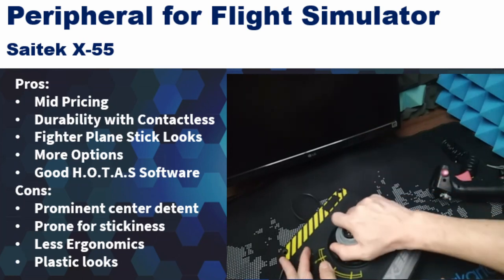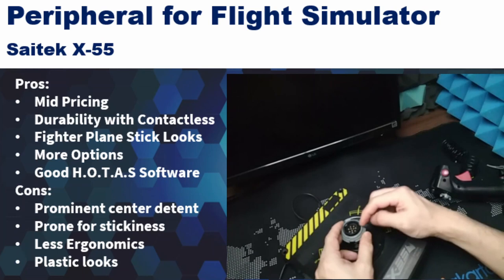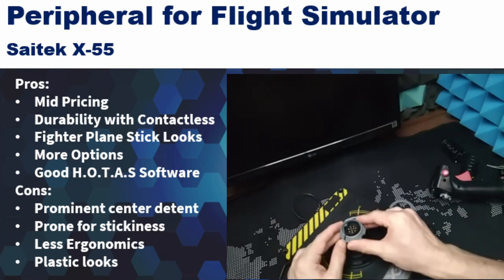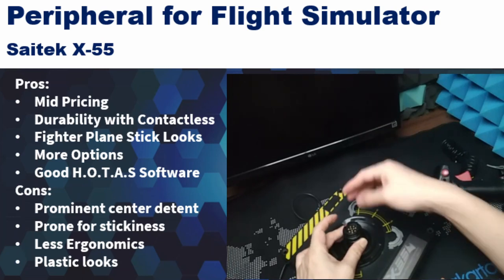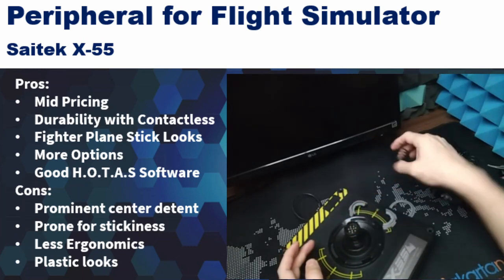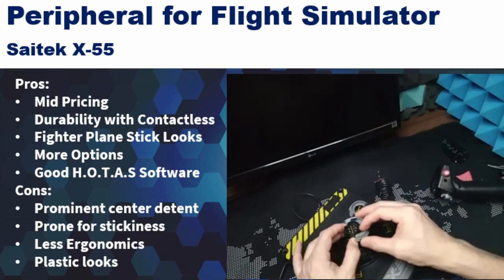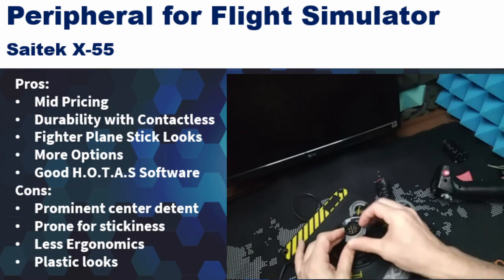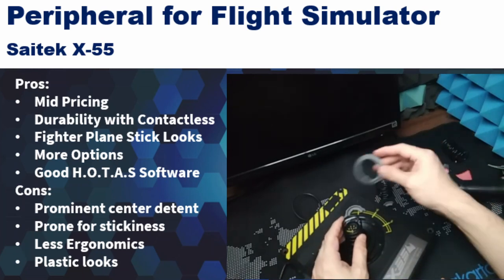So if you want to access the spring, I think you have to just unclip this one upward, okay? And then you can see there's a split in this plastic, so you can split the plastic this way, and be careful, the spring will jump. Okay, so then that's it. So you split this, and then you can access the spring, right? If you want to change to yellow, for example, you can just put it here and press it down, and there's a detent there that you have to look for. Okay, so there's a detent here, I was thinking, or here. Then the other pair from the other side will clip together and stay in place until it's secured with this ring.